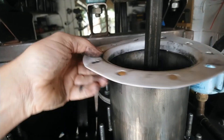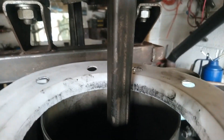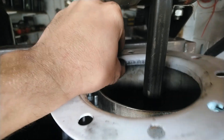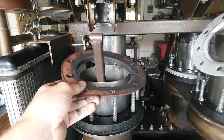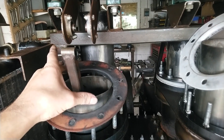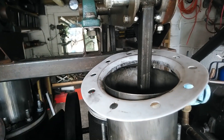One thing I've noticed is there's quite a lot of surface contact — in some places it's up to about 12mm. What I can do is actually shave a bit off to cut down the surface contact and hopefully reduce the friction. I think the way ahead on this side is to make another set of PTFE donut lip seals. What I'll do is make the inside diameter of the donut slightly bigger, so there's less contact — making it the same as this one once I've trimmed a bit off.